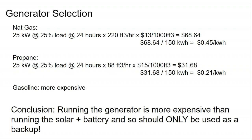And when you're talking about upwards of 20 cents a kilowatt hour, there is such a thing as running that generator too much, and instead reducing the generator runtime by increasing the battery bank size. So I'll throw the generator runtime into my model and assign it a cost. If expanding the battery system costs $700 a kilowatt hour, and I increase my battery capacity by X kilowatt hours, my generator runtime reduces by X kilowatt hours, and I save X dollars on gas. Then I look at the intended payback of this system. If the payback of the system is 15 years and I can get less than a 15-year payback on reducing the generator time by increasing the battery bank size, that's my hinge.